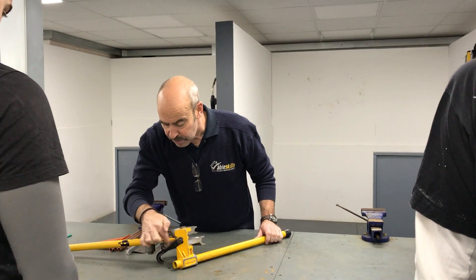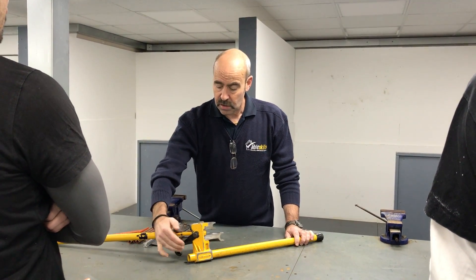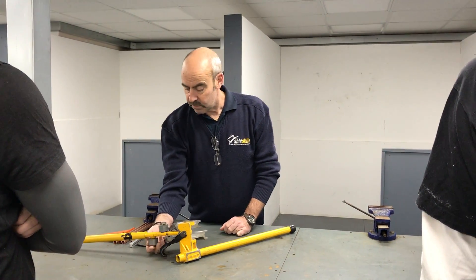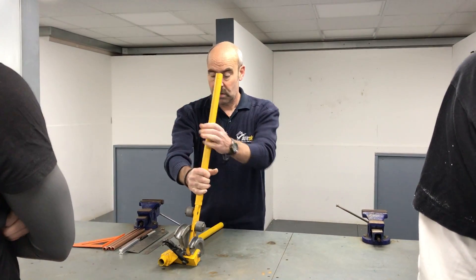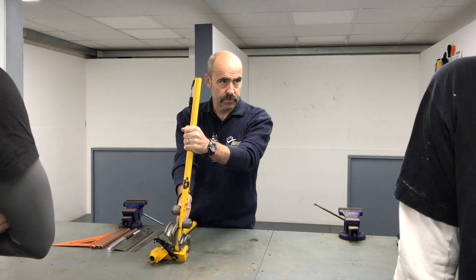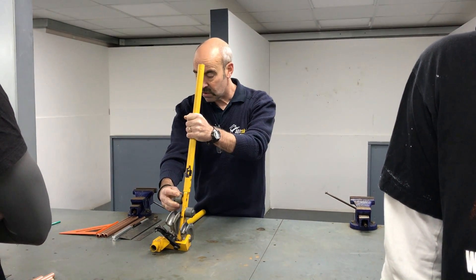Checks that you need to do: when you open the benders, you need to make sure there's a gap between the arm and the stop, so the stop can freely move. You can open the benders too far and the stop won't move. Close it with the left hand so we can operate the stop. Check the rollers move freely, then check all the nuts are tight. It's especially important on 22mm — you need to add a lot more effort for 22mm. When you put the form in, the pressure is square on into the former.